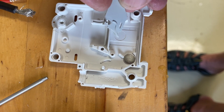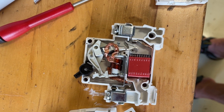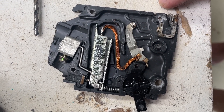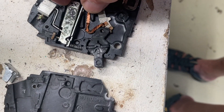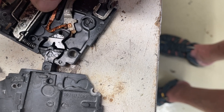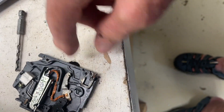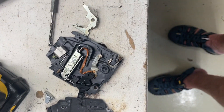I feel even better about this thing now as a disconnect switch. Obviously this isn't a lightweight piece of research — they didn't just toss this together. This has got some good engineering in it. So impressive, especially when you contrast it to this AC breaker. This works very well for what it is — it's got an easier job. All it has to do is reliably trip. There's probably a coil in here and possibly a thermostatic control, but this is the tripping mechanism that unlatches the breaker and lets the contacts snap open. So that's the difference.